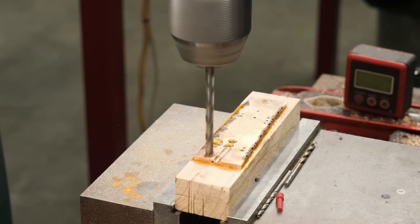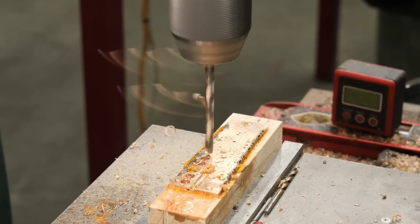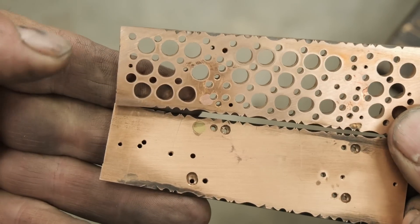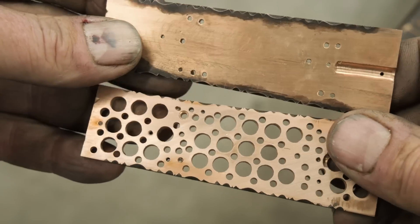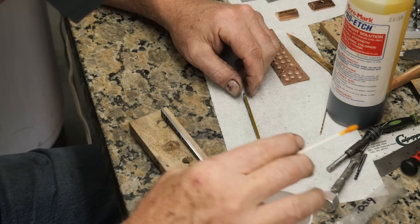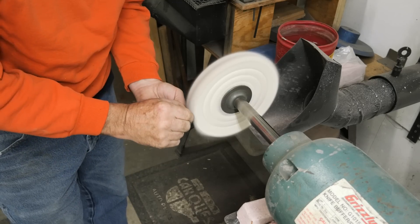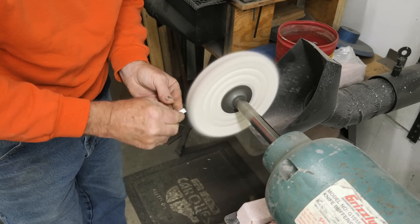I'm cannibalizing the liners to get a little bit of weight in my custom copper alloy. These frame pieces are wrought iron, so I etched them kind of heavy. Everything was so refined and smooth on the knife that I thought the contrast with the wrought iron would be a beautiful addition. The grain is exposed on the wrought iron — we have polished custom copper alloy, polished pearl, and a really refined blade.